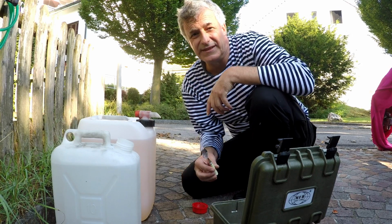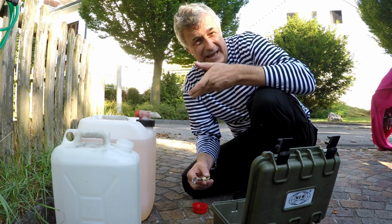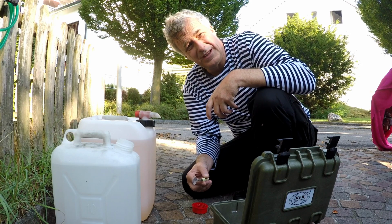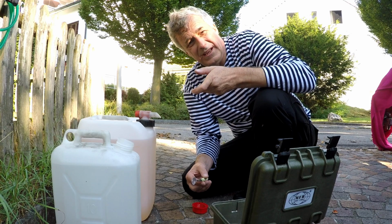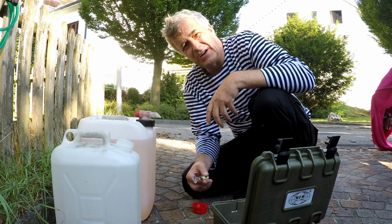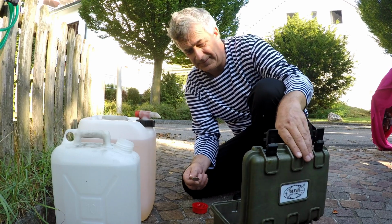This is the final process, so the soda in combination with starch will also allow to bind the oil, dissolve the oil, which accidentally is delivered to the boiler, and which is not good for the boiler. So the soda is dissolving the oil if there's some oil in the water, and finally after the cleaning of the boiler, everything is pushed out by these chemical compounds, and the boiler survives many times longer.